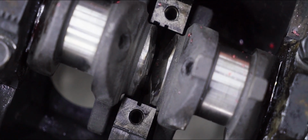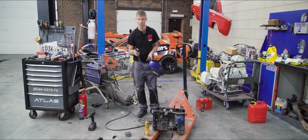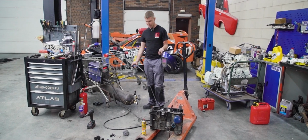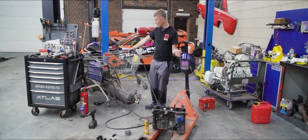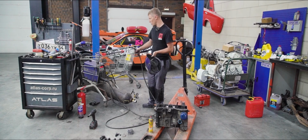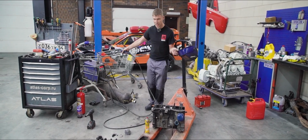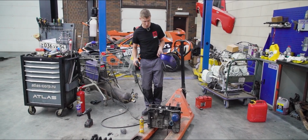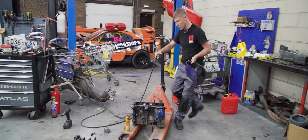Now there has to be a better way to weld iron, but we're just not aware of it. A regular old MIG welder is what we'll be using. Some regular gas, carbon dioxide, not containing any sort of special additives. We've got it set to 24 amps, which is pretty much the maximum. Well, I mean, the whole thing is actually adjusted automatically. After all, this is not the ideal piece of kit for these types of jobs. But we're going to give it a try anyway. We're sort of making it a point to do a ghetto job.